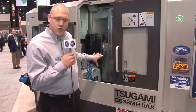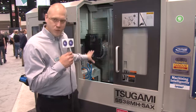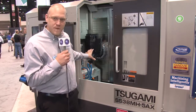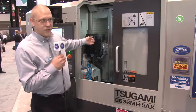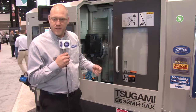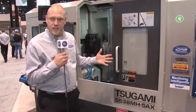This machine is a 38-millimeter Swiss-style machine, which is sliding headstock. It's also chucker convertible. We have over about 100 millimeters of stroke in chucker mode and 300 millimeters of stroke in Swiss mode. This machine has a full 20,000 RPM tool spindle that takes a Capto C4 connection. That tool spindle can work on both the main or the sub-spindle. The sub-spindle also has its own set of tools down below with five driven tools and five static to maximize your overlap time. This machine is 38 millimeters through the spindle, so up to inch-and-a-half bar. The tool spindle can actually do full five-axis contouring, which is very beneficial in the medical device industry and aerospace industries. This machine also comes standard with glass scales on X, Y, Z, and X2 for extreme accuracy and repeatability.